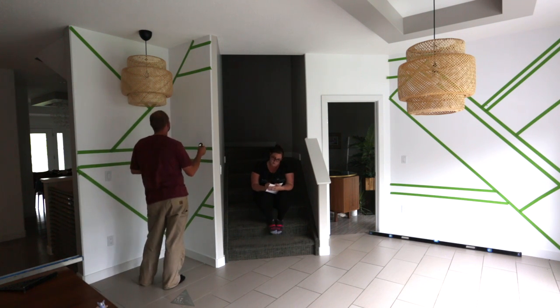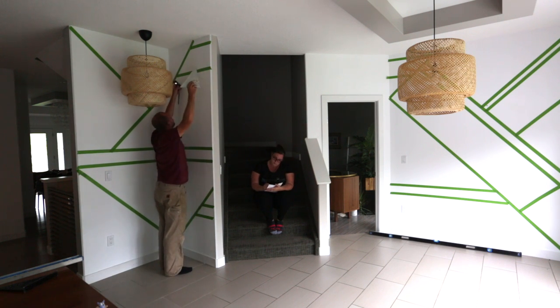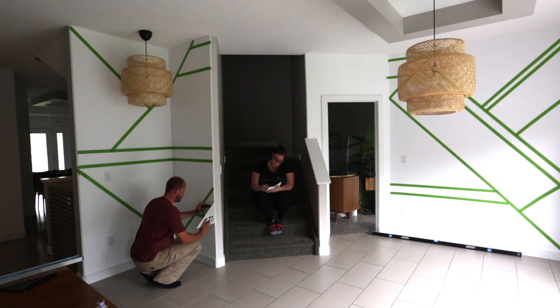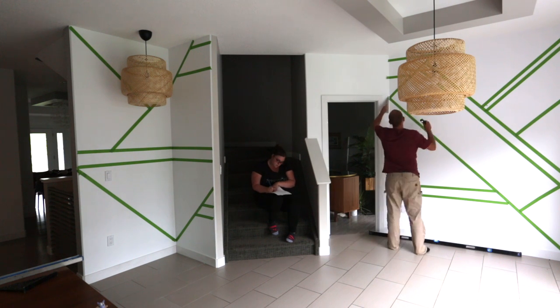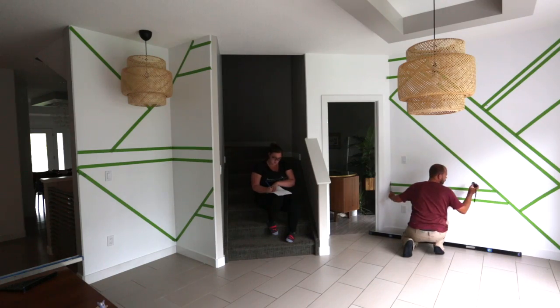Next, we had to measure out exactly how many molding pieces we need, so Russell used our laser distance measuring tool, which I will link to in the description below since we use it quite a bit, and he measured all of the lengths of each of the pieces of tape. We added all of that up and then added an extra 10% just to make sure we would have enough moldings for the wall.